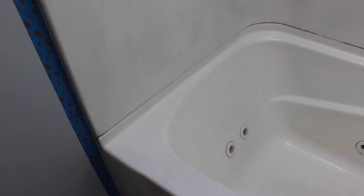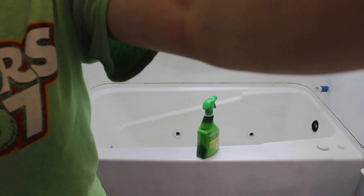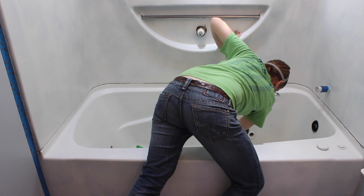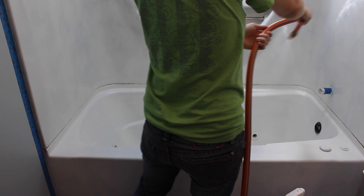What I'm doing now is removing all of the caulk, as much as I can. I'm going to take the vacuum cleaner and vacuum it all out and clean it up, then I'll be ready to do the Lime Away spraying. I took all the caulk out of the corners but got lazy around the sides — hopefully that won't be a problem. Next, spray your entire tub with Lime Away, let it sit for five minutes, then spray it all again and rinse. You're going to do two rounds of Lime Away and then rinse both sets off.